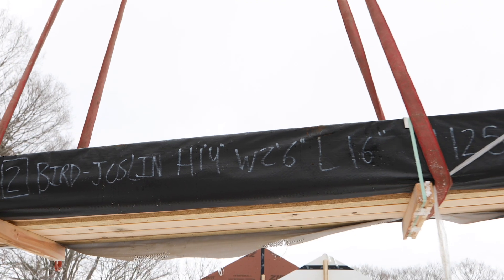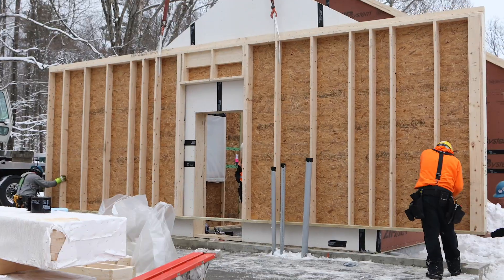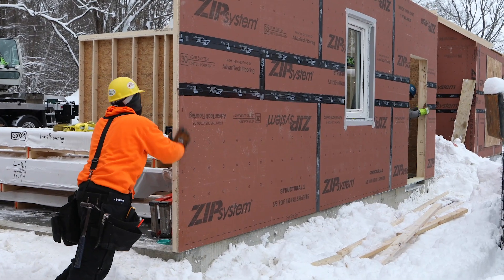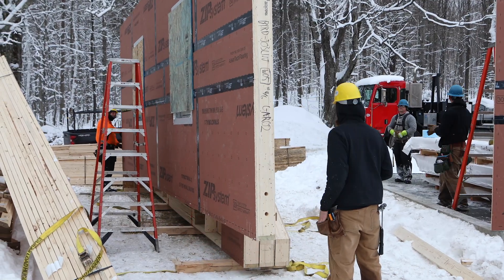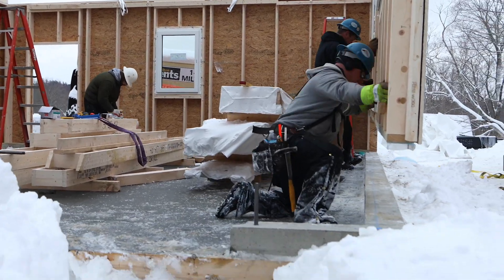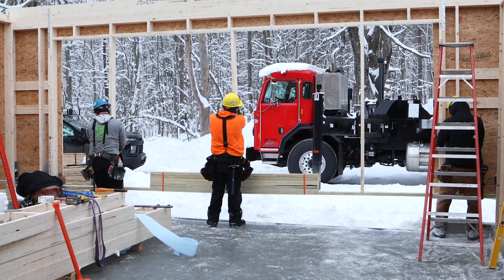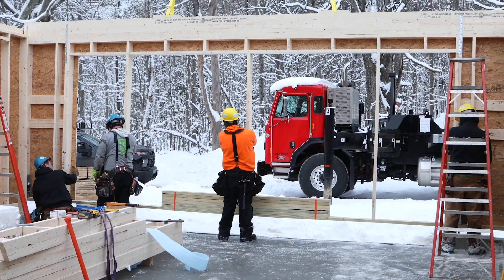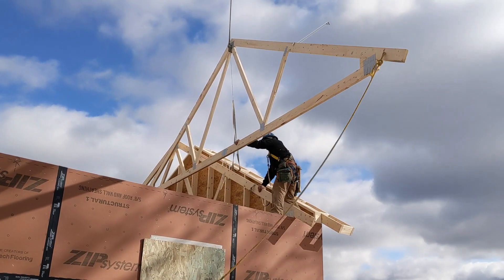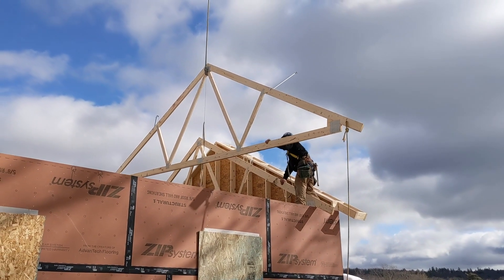Here's some framing that will be used at the gable ends of the wall panels. Now they're installing the wall panels for the garage. These are also two-by-six wall framing and are fitted with a closed cell foam gasket on the underside where the panel meets the slab. Here you see the garage panel that has the garage door opening, with braces on the bottom that'll be removed later. Now they're starting to fly the roof trusses which will form the roof framing. This is the flat ceiling style of the Xyla — if it were the vaulted ceiling version we'd be flying insulated roof panels instead.